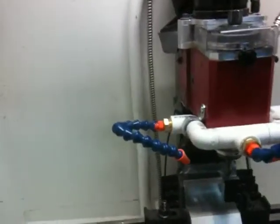It worked pretty good. The G251s are down there — they are much more capable than the old hobby CNC chopper driver. We got the C23 breakout board made by CNC4PC with the analog output hooked up to the replacement treadmill motor controller. That's the sole method of controlling the spindle.